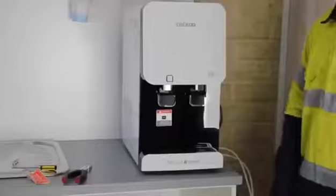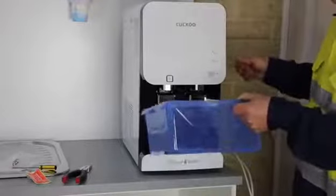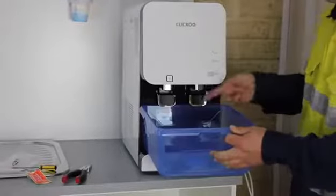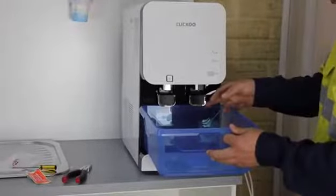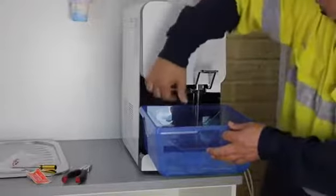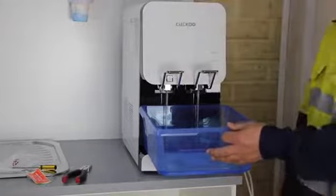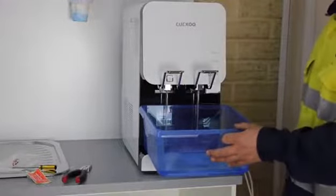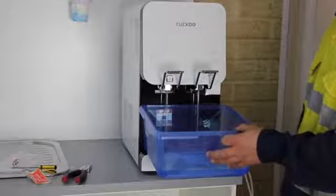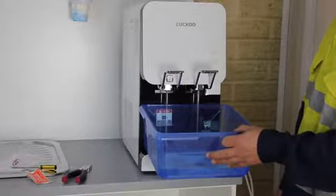Step 5. Rinse the water tank and the hot and cold faucet. When the water tank is filled up, the purifier will cut off the water itself. Shut off the valve to stop water supply. Now, get a 5-liter or bigger container under the hot and cold faucet. Lift up both faucet switches to release all water from the purifier. When finished, discard the water and turn back on the shut-off valve.